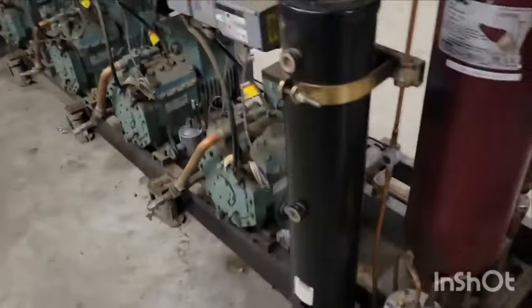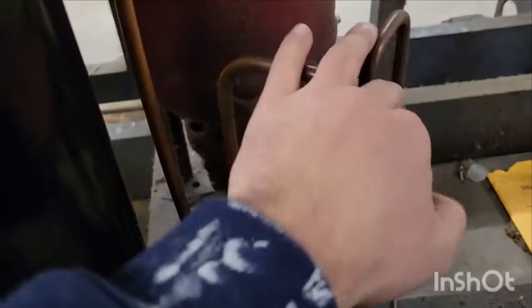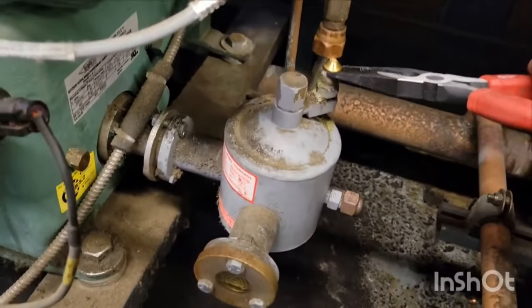And I also want to throw in there, because this is just a different kind of oil system, a super quick run through: warm oil line right there, oil filter, oil reservoir, check valve, come out of there, float. Well, actually, it goes from here to the reservoir, check valve, out of the reservoir, oil filter, and then into the floats, and those are all the floats. Thought I would show you, there's a float screen right here, you see?